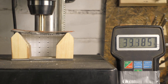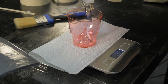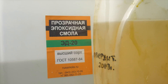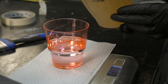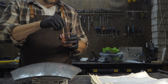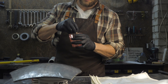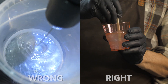The topic of strength will be discussed in more detail in the fourth part. Weigh all cut sheets on a kitchen scale — the total weight of epoxy and hardener must match the weight of all fabric sheets. For example, 300 grams fiberglass and 300 grams epoxy with hardener, plus a 5% margin. If you are working with structural epoxy as thick as caramel, prepare it in small portions of a maximum of 100 grams. After adding a hardener, such a resin begins to thicken quickly, which complicates application of the last layers. Carefully mix the resin with hardener for at least four minutes in the first glass, then pour the composition into a second glass and mix for four minutes there, to avoid unmixed resin volumes which always remain on the edges and bottom of the first glass. Mix only by hand without a mixer, so as not to let air into the resin.